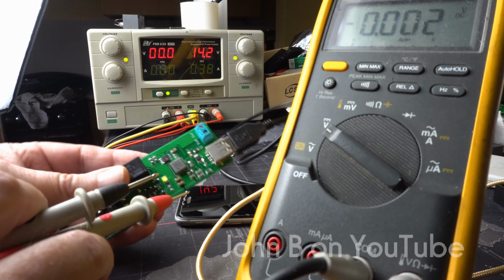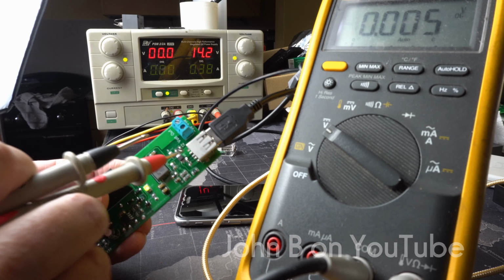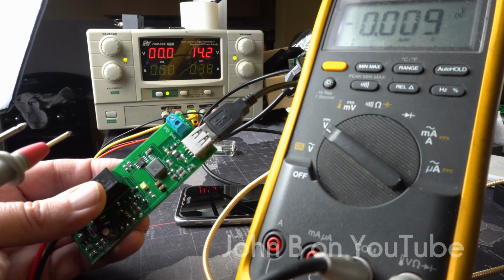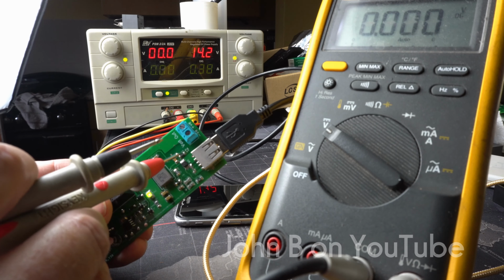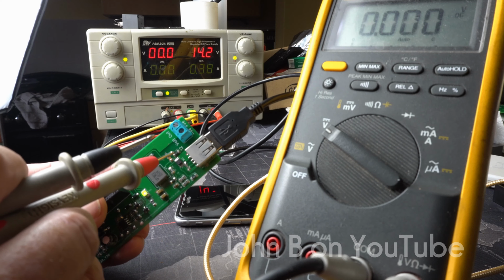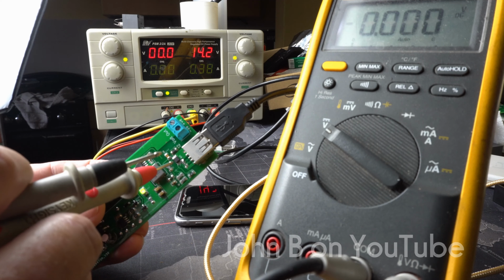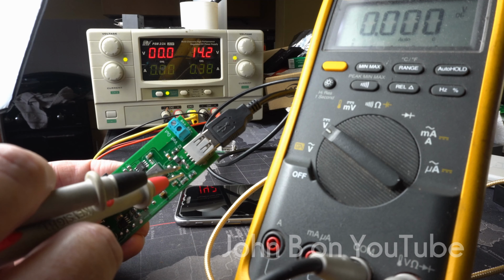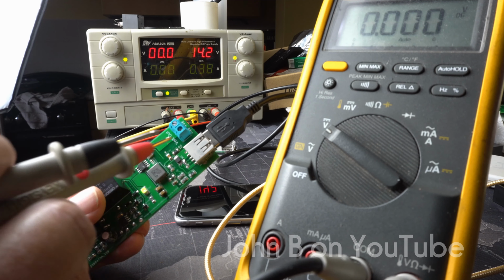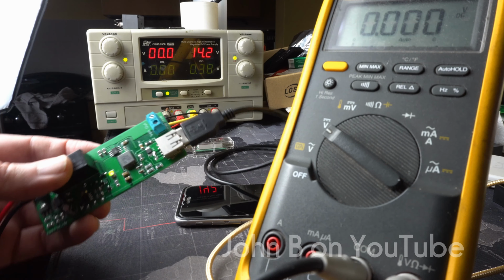And it's measuring, don't know if you can see, there's a tiny little wire there on the ground, and the positive there. 2 data lines coming to this chip. That's the current limit resistor just there, which I've set to 46K2, which is about 1.1 amps, which means at half an amp the chip select will start pulling that line down to boost the voltage at half an amp, anything over half an amp. And you see there with the long cable extension, the voltage starts coming up.